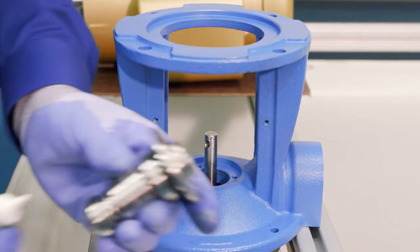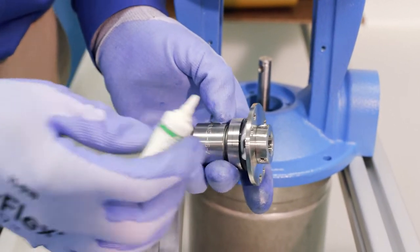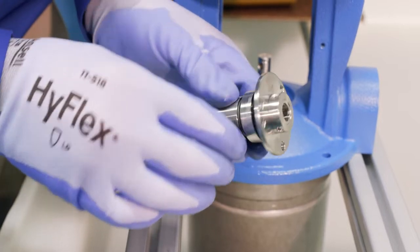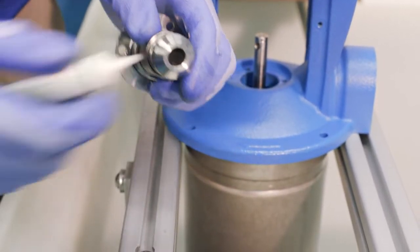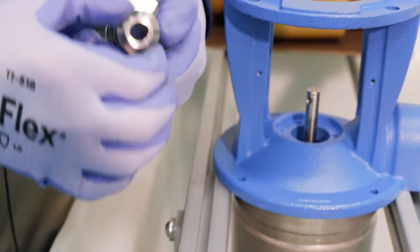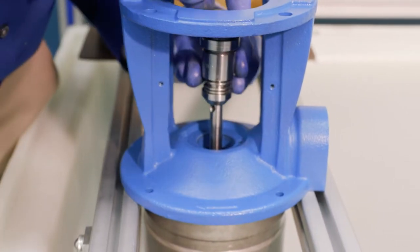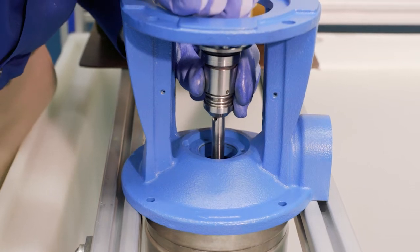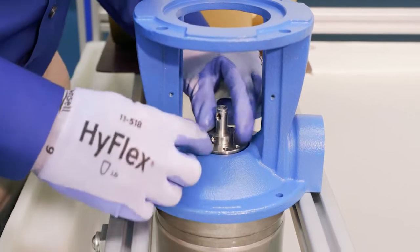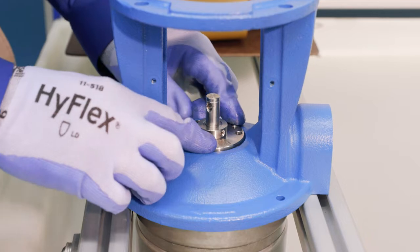We're going to apply a little P80 lubricant to the O-ring on the outside of the seal so it'll slide down into the seal housing, and also a little on the inner O-ring, since we have a dry seal going onto a dry shaft. We bring the seal in from the top, set it in place, and gently push it downward onto the shaft. We then line up our mounting holes that will lock the seal plate into position.